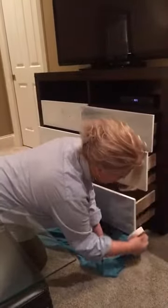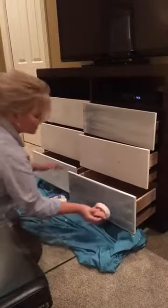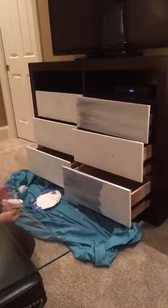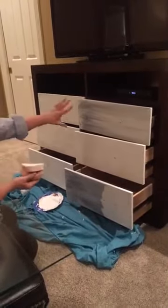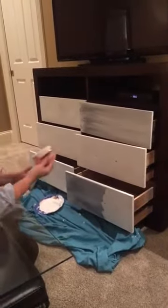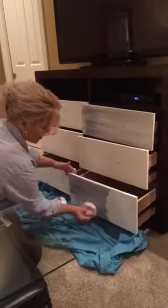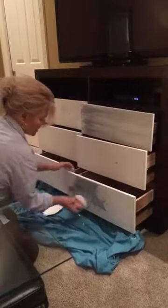Just another coat going on down here, watching the sides of the drawers, strapping them, then tapping on the next coat. Very important — you have to always let your first coat of paint dry. Especially when you're working with whites: if you don't let the paint dry and you come in when this coat is a little bit soft, this coat will wet that coat and then you begin to remove them. So it won't be ready for a second coat for 30 minutes to an hour depending on your weather. Just wait, come back after it's dried, and put on your next coat.